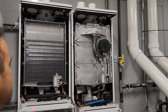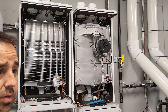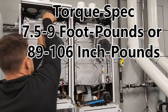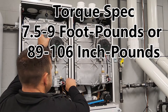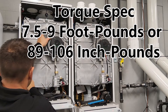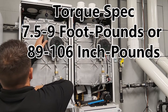So now after I'm done cleaning and rinsing off my Axiom cleaner, I already have the igniter cleaned and I'm probably still cycling my fluid through the water side to clean that portion of it. I'm just going to bring my cover back on. We definitely have a certain torque spec with this. With the drill bit, I'm not going to tighten too hard — I might not even use my drill bit to tighten them all down. I might just use my Allen key and get them right there. I get all those bolts back up there in place.